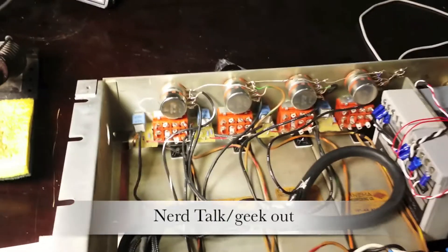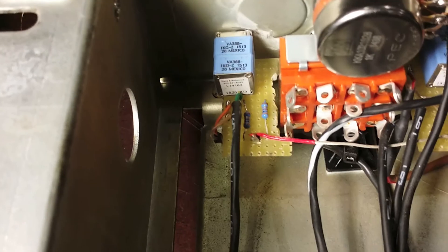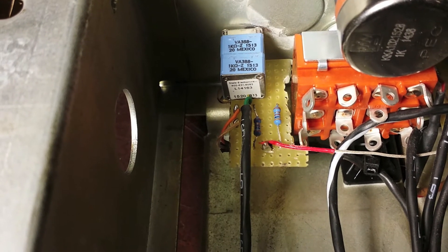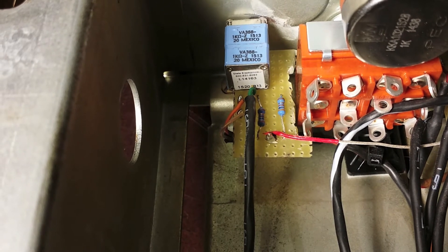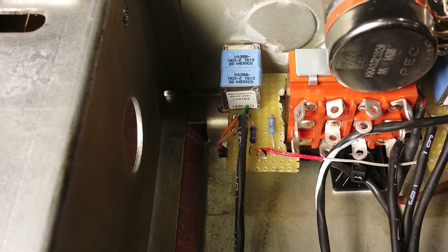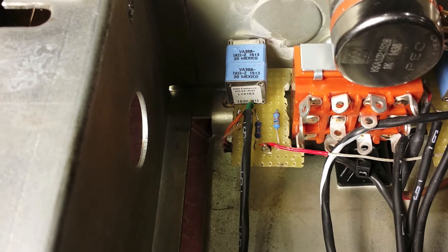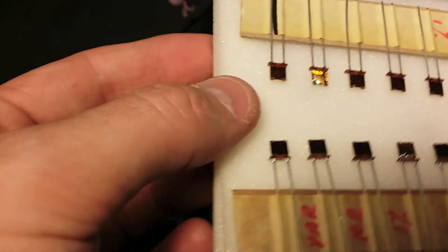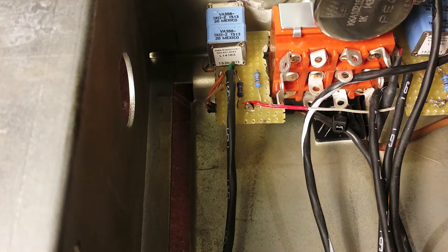What I'm about to do now is replace these run-of-the-mill metal film resistors that I have shunting these custom pots to ground. These pots are dual 1Ks cut in half, so you end up getting around 500 to 600 ohms — essentially a 600-ohm symmetrically balanced attenuator O-pad. We're replacing the average resistor with naked bulk foil metal resistors at 2 parts per million noise, replacing probably 50 parts per million noise.